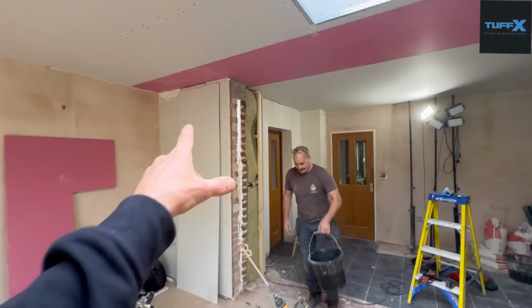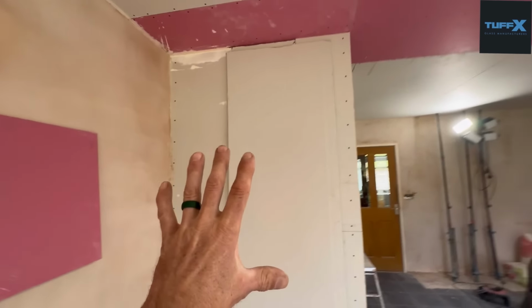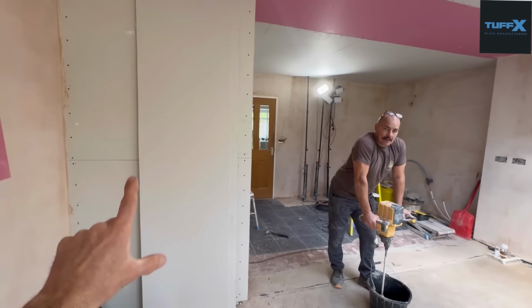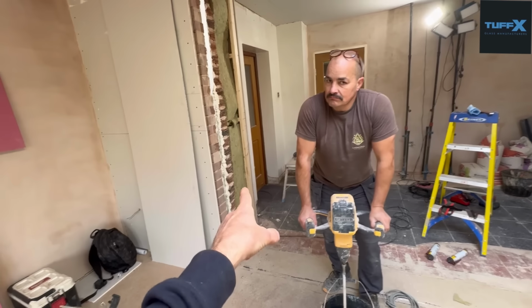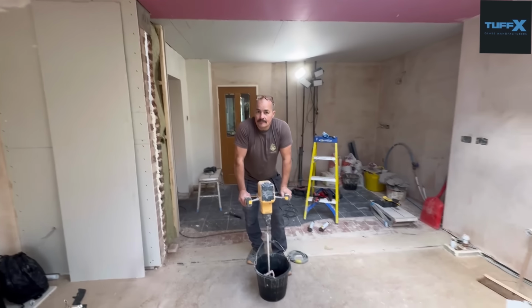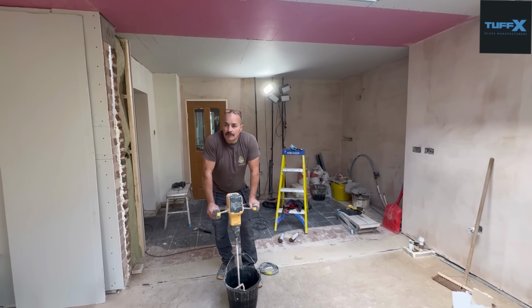What he wants is to get that board on. He has just put that board on behind this one. He's put the insulation in there. You've already seen part of that done already. Put the 50mm Kingspan over the top, or Recticel, which is what we're using. Foamed it in. That board now, once he's done mixing, will be dabbed onto there and then mechanically fixed into that timber and the timber behind there as well. And other than beads and scrim, back to plaster again, haven't we? Catapulting it on, mate. Yeah.